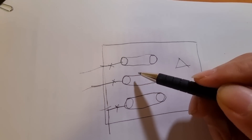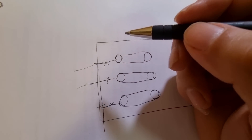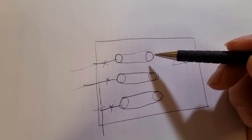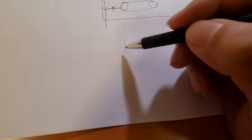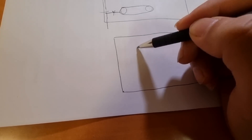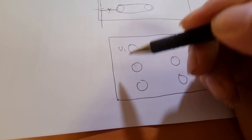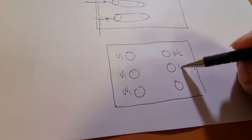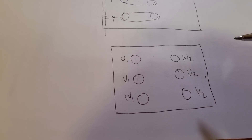The reason I am removing the wires is to separate the condition of the cable from the condition of the motor itself. In order to measure the insulation resistance and the condition of the winding, I also need to remove the plates. The cable tagging is U1, V1, W1, and W2, U2, V2. Inside, the windings are arranged like this.